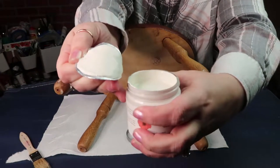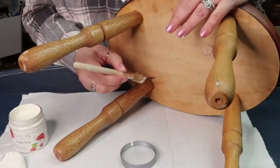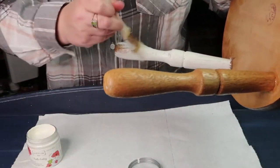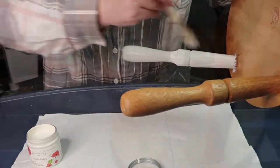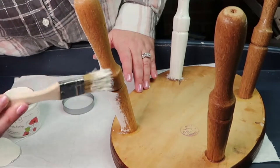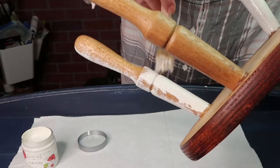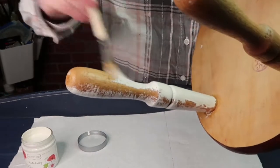This is the most creamy paint ever — great coverage. My plan is to get started on the legs first. You want to use enough, but not too much; you don't want it dripping. Make sure that you go up and down and side to side. Start with your legs — this is so important. You don't want to start on the top, then have to turn it over, and ruin your top. So start with the legs, get those painted, and then turn it back around.